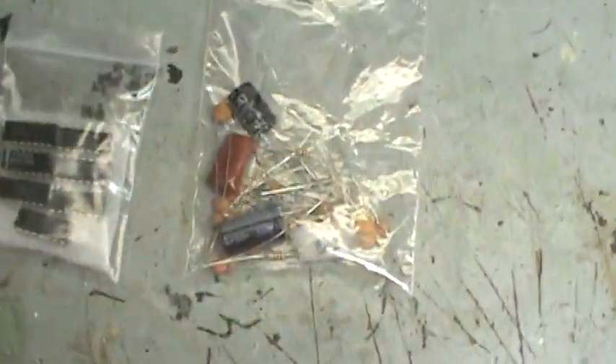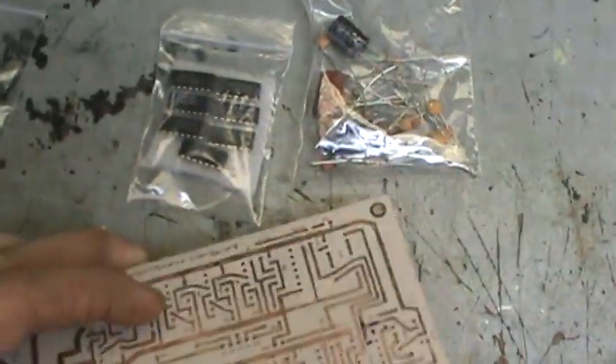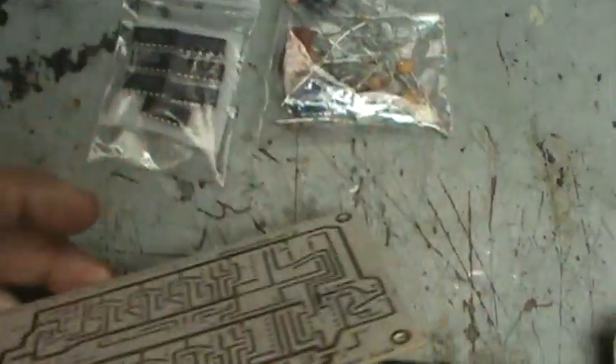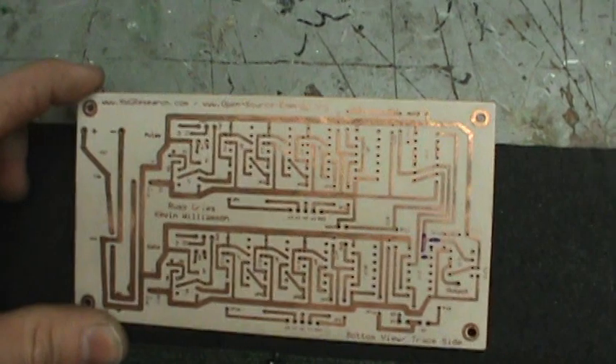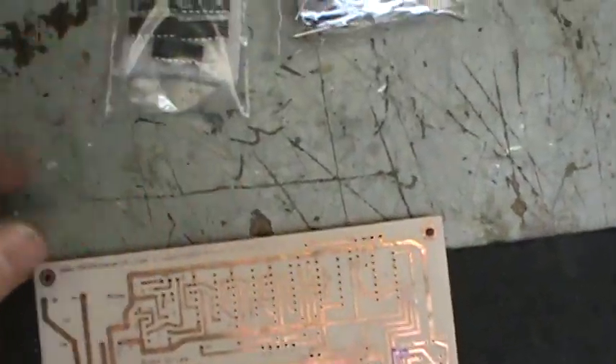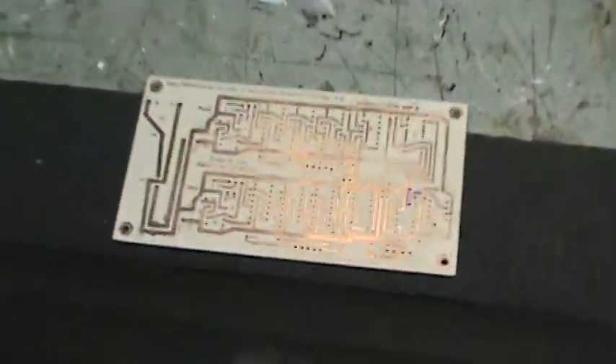Here are some of the components: resistors, capacitors, a few other things, and the IC chips. I'm going to put 14-pin adapters on here so I can just plug in the chips in case I fry some — which will probably happen. There's not much protection in this circuit because of the transients, and the ICs are probably going to slowly degrade. So I'll be able to plug and play on most of my components. And then a few diodes and what is that — IRFP264.